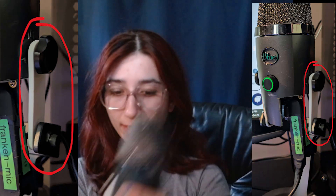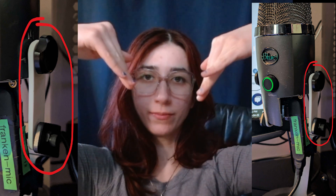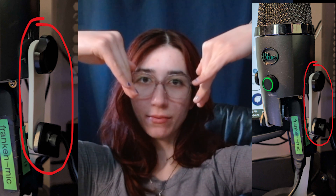The problem with having this larger reinforcement zone and now my cut case is that the microphone body itself is a lot longer than the original. That meant it needed to sit a little bit higher on the stand. Originally I had some straight brackets that I made in CAD super quick — they would pinch the microphone on the inside, and it would tend to kind of flop over because it was too top-heavy. That's where we're looking at an angled bracket.